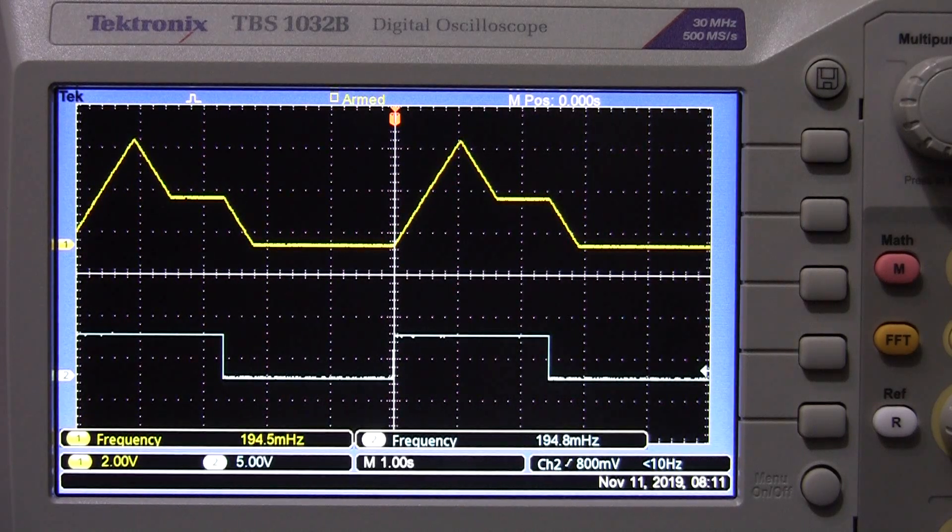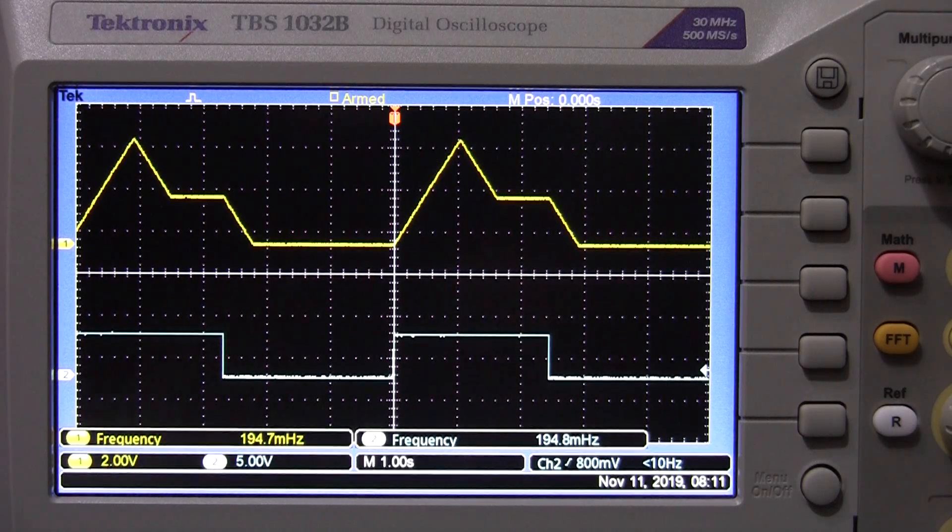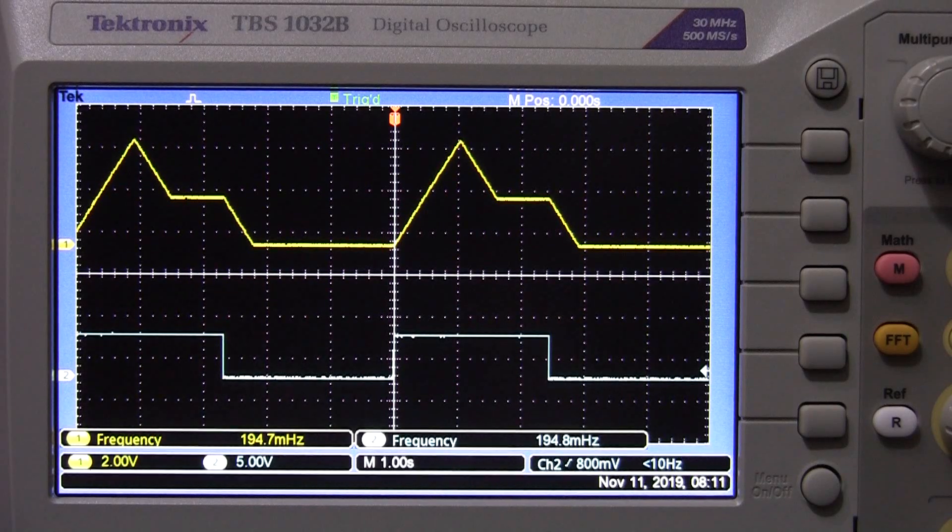The Envelope Plus can act as dual envelopes, it can act as a sequencer, and it has a whole lot of features allowing time control of the attack and voltage control of the attack and decay. But we're just going to look at it in its regular mode mimicking a standard ADSR. What we're looking at is the same sort of waveform, except that we have a completely linear — straight line — change over time from zero level to the maximum attack level, dropping to the sustain level via the decay time as a straight line function, then a straight line fall-off of the release time.